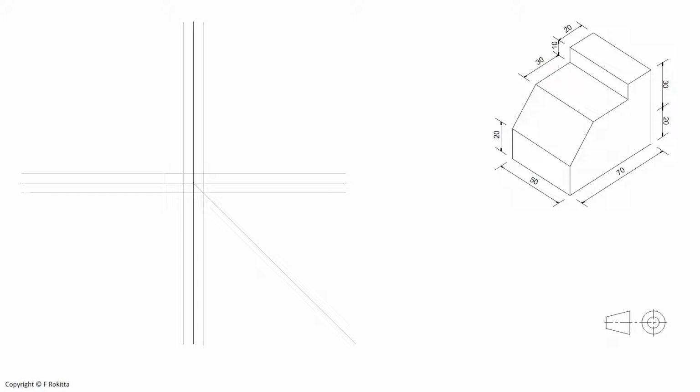When we start our drawing, we will make sure that we start from the anchor point of each of the different views. In this case, we will start with the front view first. We will draw a light construction line at a height of 50 mm from the anchor point onto our front view, and we will keep the projection going through to the left view.